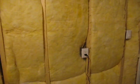Since this space is going to be cooled to about 55 degrees and the outside temperature is obviously greater than that, it'll be prone to condensation. So I have to have that vapor barrier to prevent any condensation. I'm going to try and install a vapor barrier in between each one of these studs and on the back of the frame before I raise it up on both of these walls.